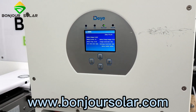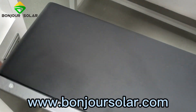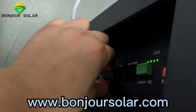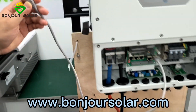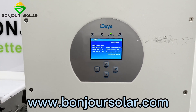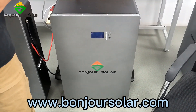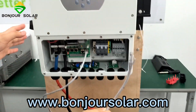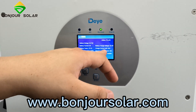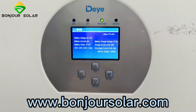Let's do a small test. If we disconnect the communication cable for one battery — so now that means we have only one piece of lithium battery connected. You can see we have only connected one piece — the second battery is no longer in parallel. The charge current limit has changed automatically to 95 amps, and the discharge has also changed automatically to 95 amps.